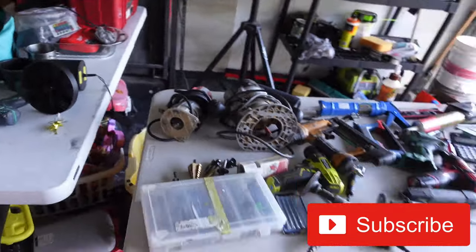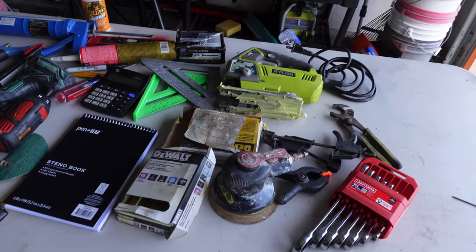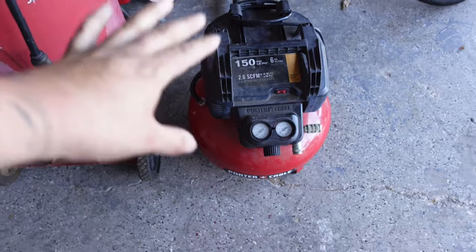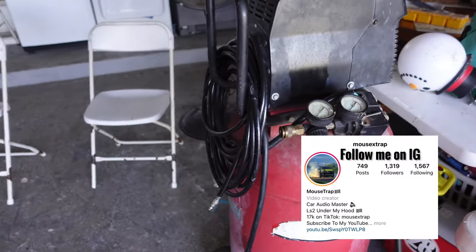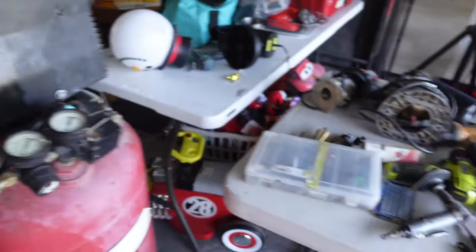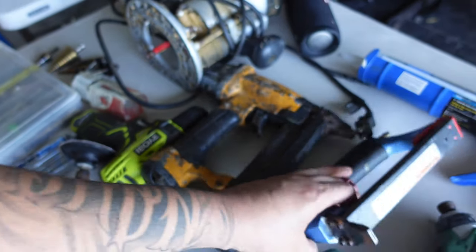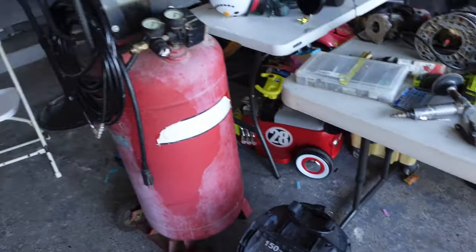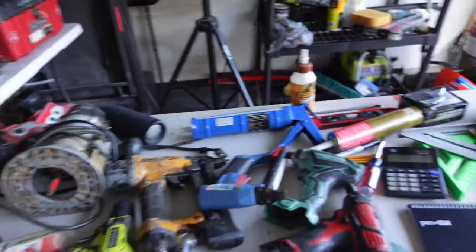All these tools you're seeing right here — I probably missed some, but for the majority these are the tools you're going to need for car audio woodworking in your backyard. We'll start with compressors. We've got the little small pancake compressor and the bigger compressor. I've built some loud systems with the big one — I've had it for almost 10 years. This one powers my DA sander and my upholstery stapler. I use the little pancake when I just want to use the upholstery stapler, since I can lower the pressure. A compressor is always a must — always make sure you've got a good one with enough horsepower so it never fails you.